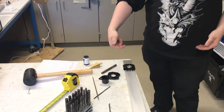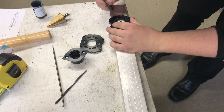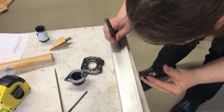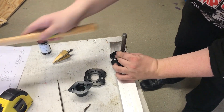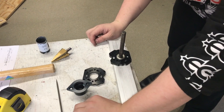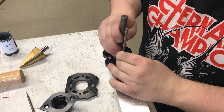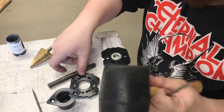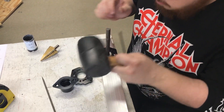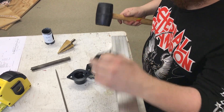So if I line it up like this, the center of the hole will be slightly closer to what's going to be the bottom of our piece on this side. I'm going to scribe out my mark here, line up with the cross, slide this on top. Transfer punch. Now the next two holes is where we're really going to use the geometry to our advantage. I'm taking the transfer punch from my side holes that we've got to drill, slide this off, transfer punch, line it all back up again real quick, take it over to this hole, transfer punch. That's how you mark up a piece of VersaFrame without any precision machining.